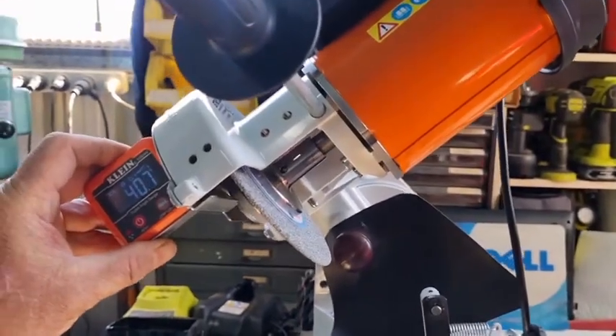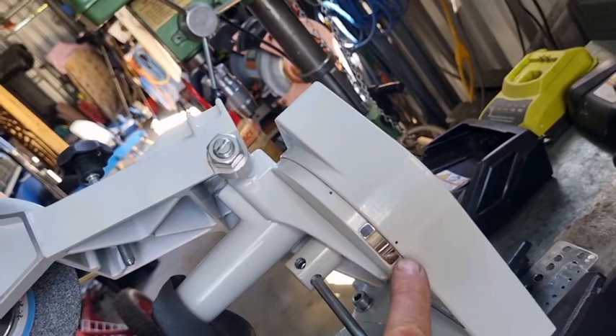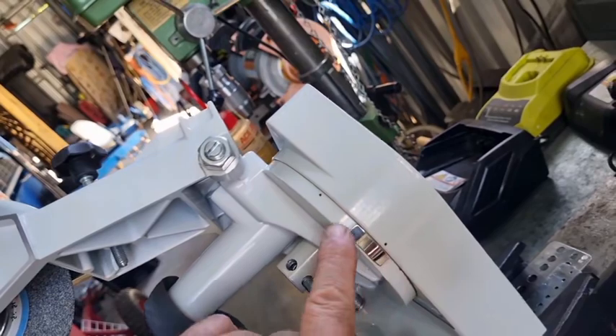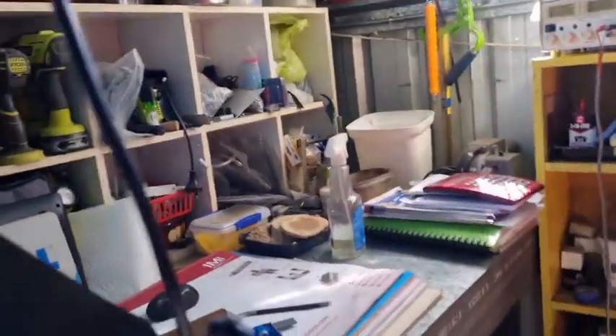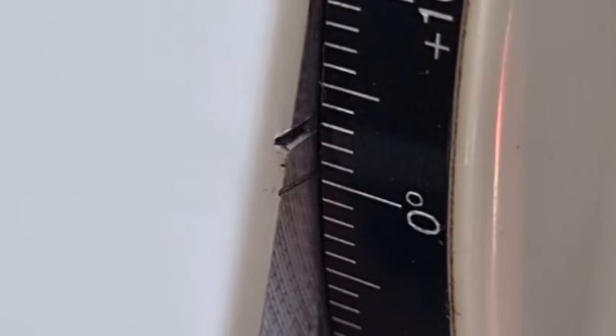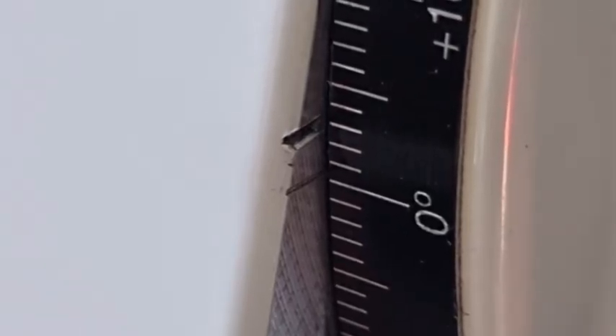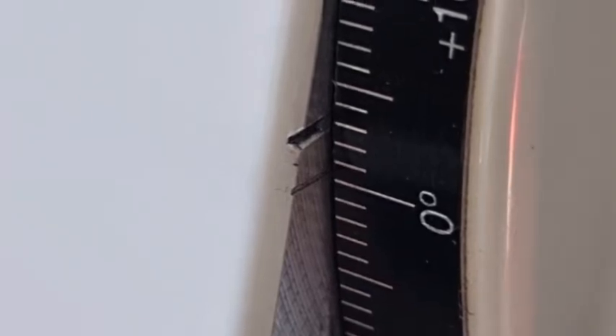That's on my mark that I've made. The marks that I've made are on the back here - little black texta mark. I center-punched it and put a bit of black texta, and put this stainless steel plate. There's three scribe marks on it. If you go to the original marking, there's the original mark on the bottom - that's lined up from the factory, but it's three degrees out. I've got to move it up an additional three degrees to that black mark, and that is the true zero degrees. So that's the little modification you need to do on the back plate - mark it with either a texta or center-punch, and you'll be at the correct mark.